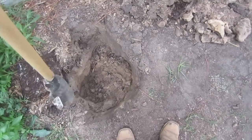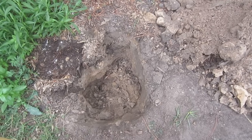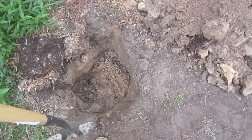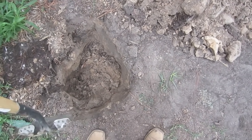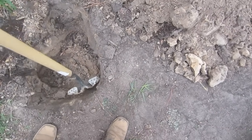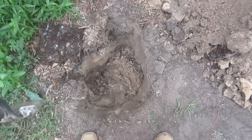I did not have to dig over here, here, or here. I only had to dig on one fourth of the amount of space that you would think you would need. Now, if you dug all the way around the post, you can't get very far down, so you end up digging out this big of an area all the way around the post anyway. Here, I only removed the dirt from this one side.